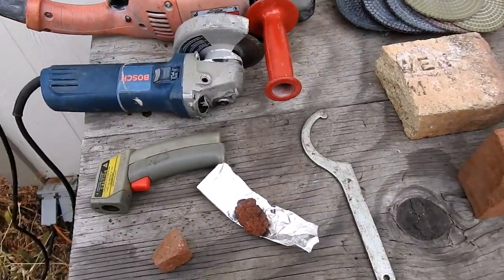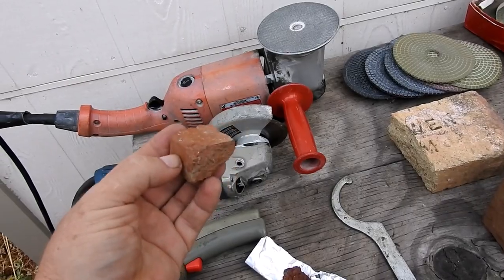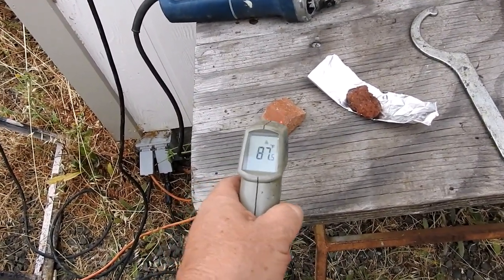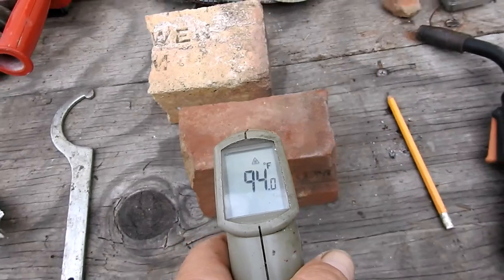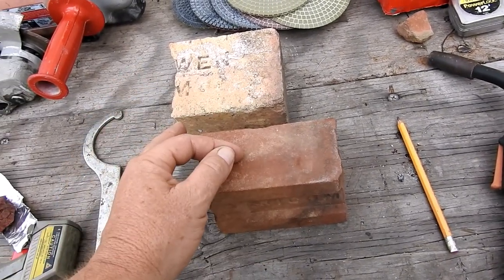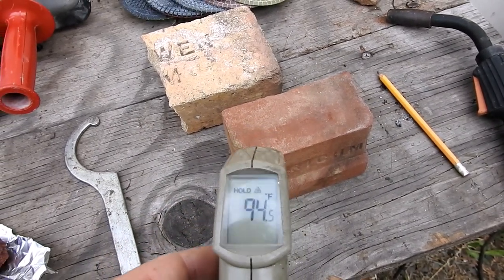So the aluminum foil starts to spark after about 15 seconds. And my first preliminary is that this brick starts to get hot after 30 seconds. And I will be using the infrared laser pyrometer, so we'll be able to see what the temperatures of our samples yield. That's going to be really interesting to see, once the heat penetration starts to expand, you'll see the change in the color, you'll see the change in the composition, and it'll be curious right after the initial welding to see how far the heat penetrates towards the edge.